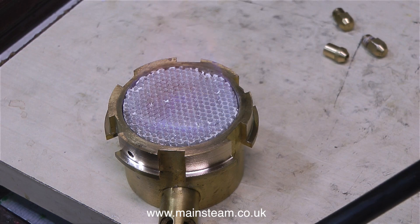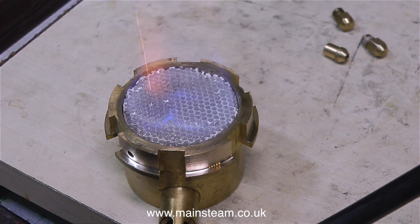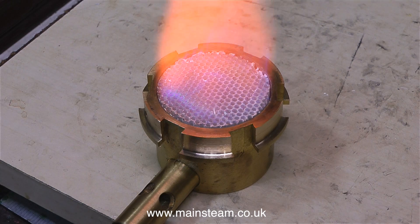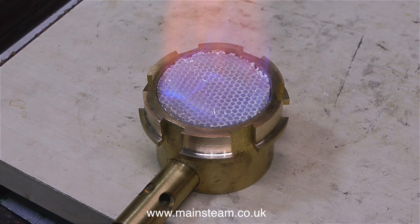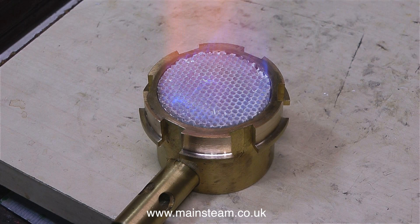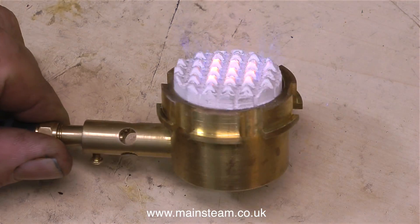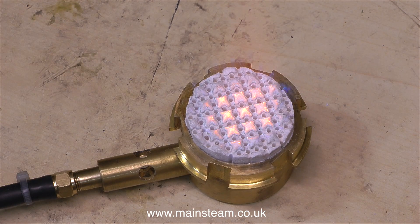I'm going to revisit this Mack Steam ceramic burner. This particular burner was taken out of a Mack Steam boiler because it kept overheating — I spoke to Mike Abbott about this and he said it was the type of ceramic he was using. This is very similar to the ceramic used in Bix burners, and they're also prone to the same problem if the position of the jet is incorrectly set: suddenly the flame sucks back inside the burner and burns inside, cremating the ceramic. So I changed the ceramic for a type that Mike Abbott used to use in his early burners — they always seemed to work very well. They howled a bit, but they worked very well.